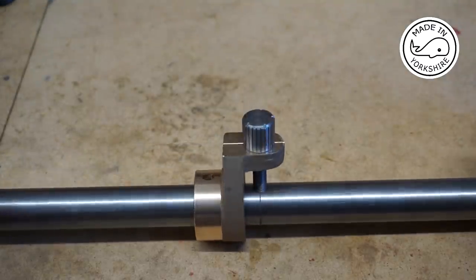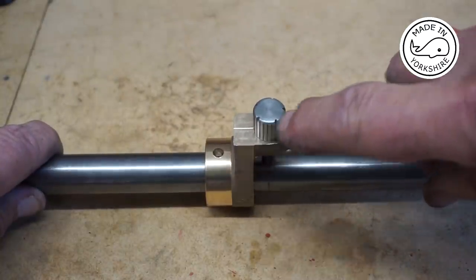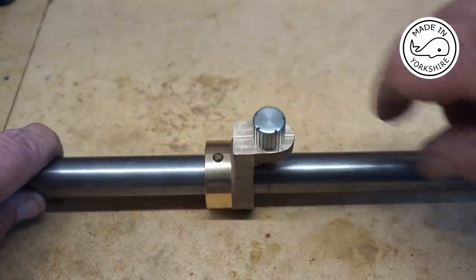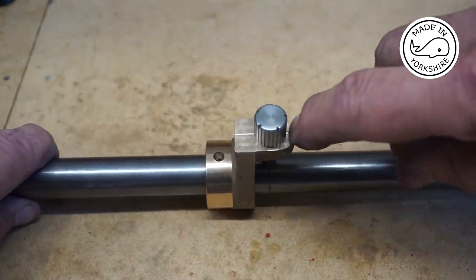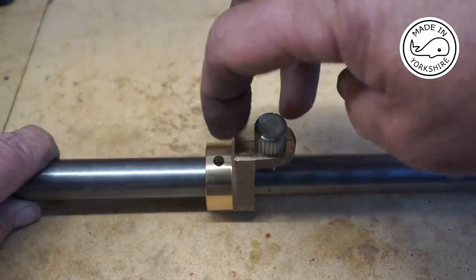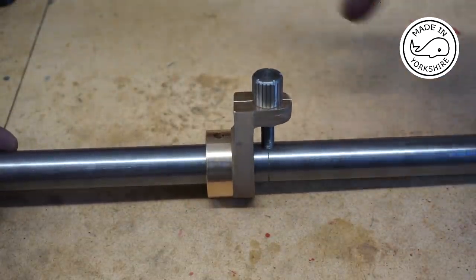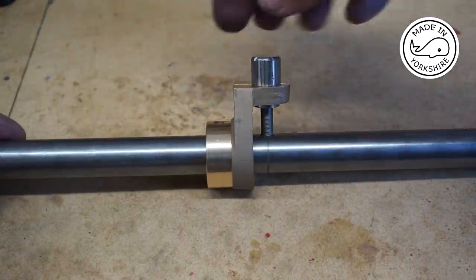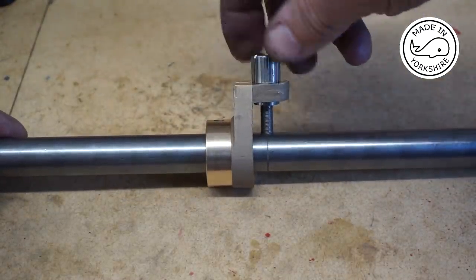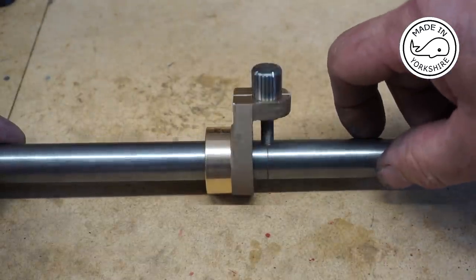Well, that's worked out pretty well. Put some marks on up here, every fifth one, and a line across. So I just did that in the mill using that gear cutter again. So what I need to do now is to make a little dimple for the locking screw to go into, and the way to do that is you screw this into the position where the tool's going to go, and